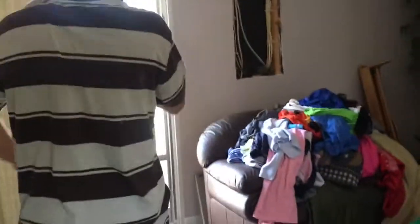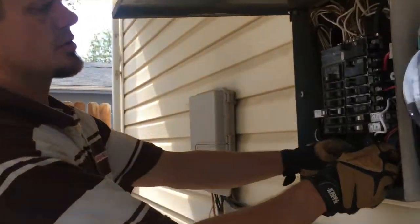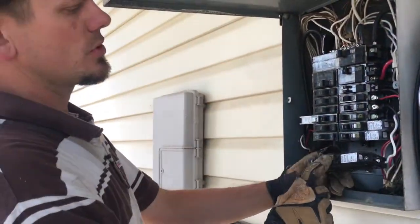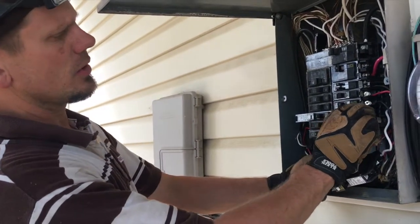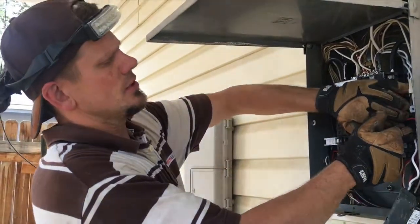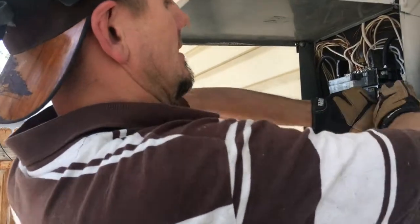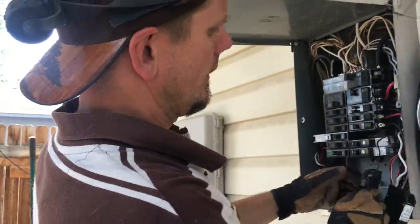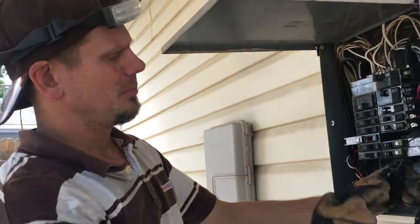For those of you who don't like arc fault breakers and I've heard a lot of complaints — I tell you, this is proof. The arc fault did a very good job. It was tripping, though it wasn't shorting out in the grass — it sensed the moisture. But when I put a normal breaker back in, that's the only circuit on right now, and I couldn't even get it to trip when I was trying to weld with it out there on that extension cord.